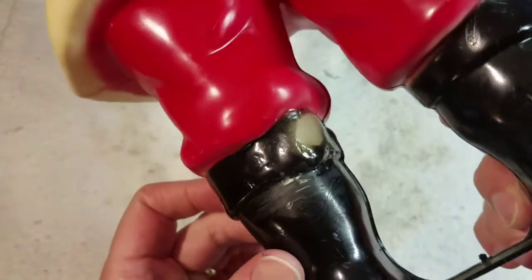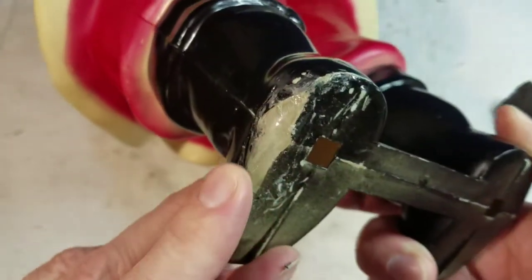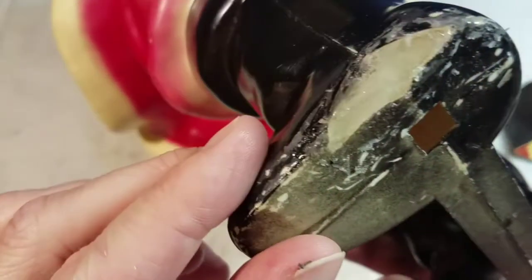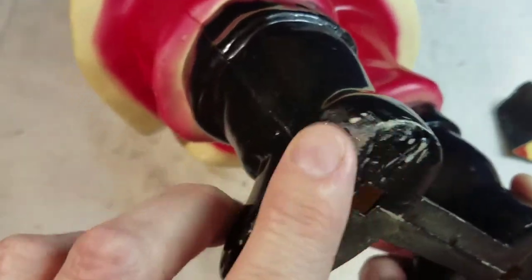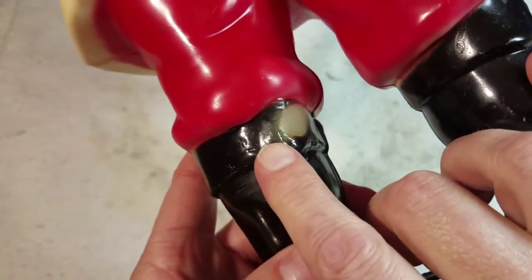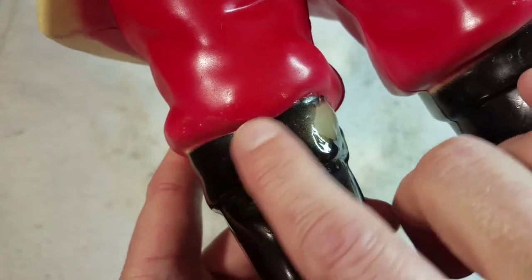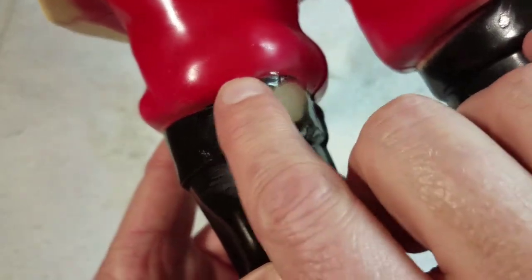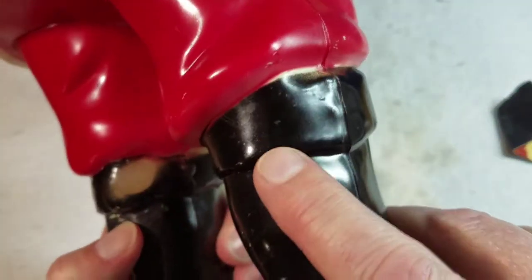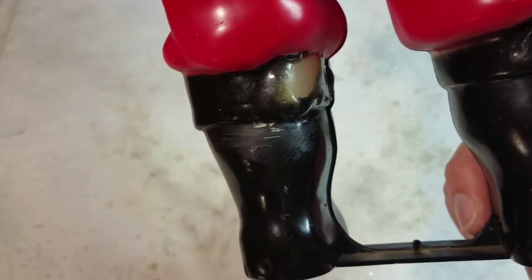Alright, so I'm back. It's fairly dry. I went ahead and filled in that hole that was still there, so it's fairly smooth. You can see I've been doing a little bit of sanding on it, but I'm getting ready to get a little aggressive. I also felt a little bad about this dimple here, so I put a little bit more epoxy in here. I'm going to sand this down, but to try to hide that little dimple a little bit more, so it'll look more hopefully like that. It won't be exact, but just wanted to show that a little bit more.